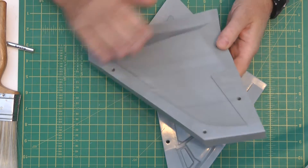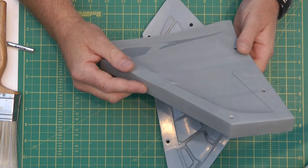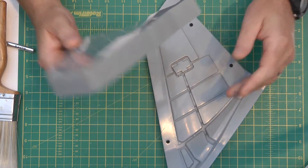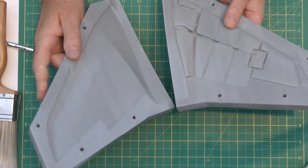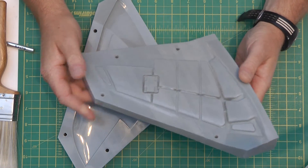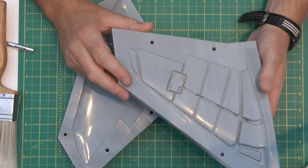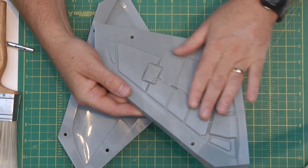I just imagine doing all sorts of different things — different colours, different textures. But anyway, I've gone off on a tangent. On the core part of the mould, I haven't spent as much time finishing this, so there are still scratches and dents in the faces. All I'm really interested in for this part is making sure there's nothing in the mould that's going to key the foam bit in — we just want the foam to pop out.